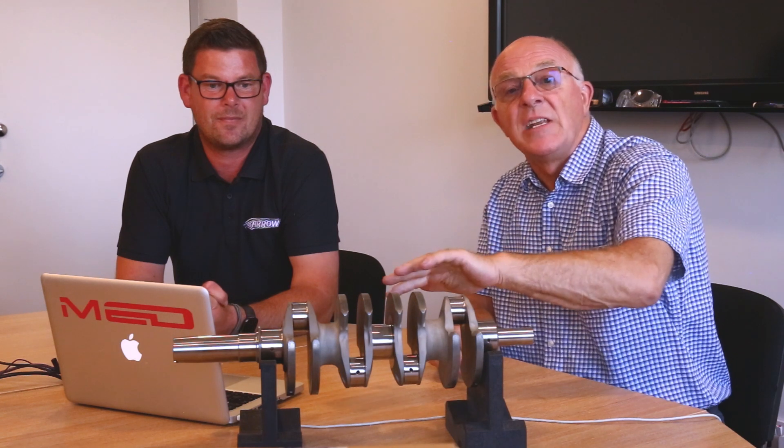Okay then, that's part one complete. Thank you very much Stuart. Part two is going to show the finished grinding. Straight after the nitriding we're going to put it on the Studer, grind up the ends, grind all the flanges, then balance it, put it in inspection, and put it in a box. Just one final point — this is a mini crankshaft we have here; this has got the nose on it. The crankshaft that's actually in the video is a Sprite Midget crank, which has a flange, just in case there's any confusion.